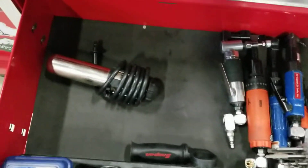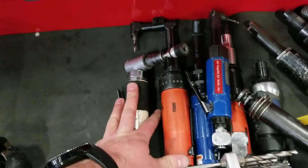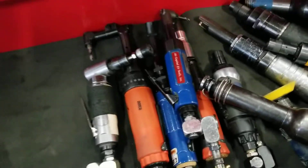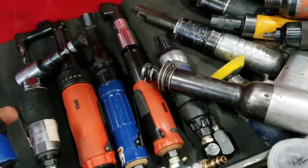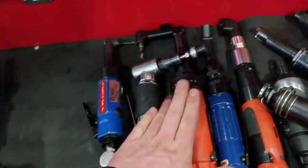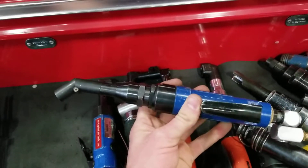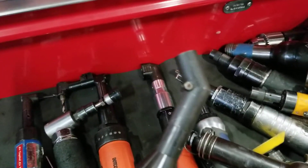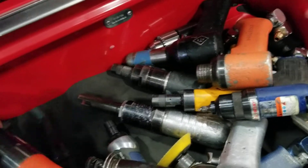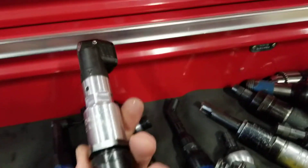A sealant gun is always a great thing to have. As a structures mechanic, having a die grinder is a must for sure. Dotco 360 motor — Dotco is one of my favorite brands. I have an ACAT here — actually a couple of ACAT 90s. This is a smaller 90 that gets into a lot of good tight spots, and if I can't get into those with that, I'll use this one or a 10-piece drill kit from stores. Here's an ACAT 45-degree, which I don't use too often, mostly because you can't put a lot of power on these heads — they will warp and get destroyed quickly. For bigger fittings, we have an HD head — Jiffy brand on a Dotco motor. This is a 480 RPM motor and it works really great.